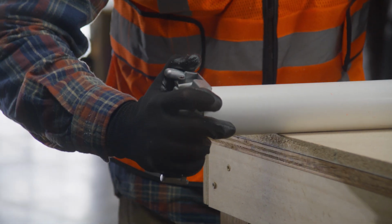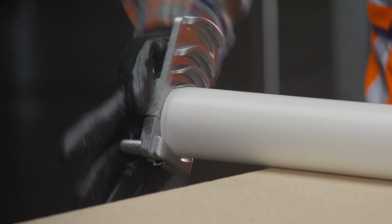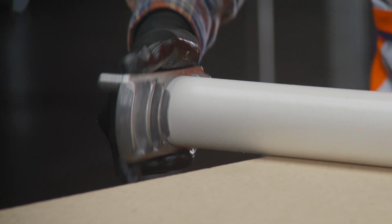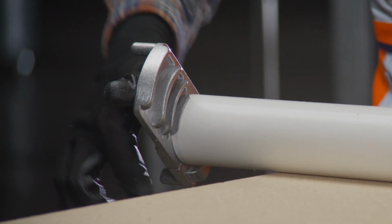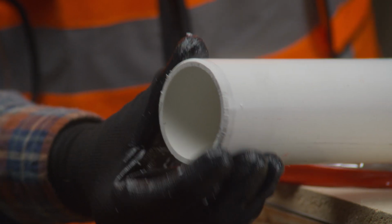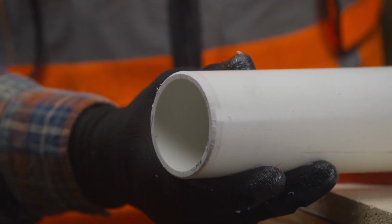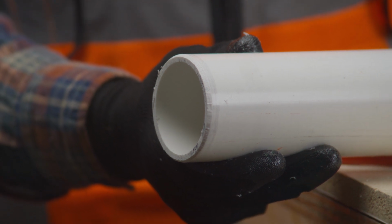Remove inside diameter burrs or raised beads with an internal deburring tool, knife, or power beveling tool. To remove the burrs or raised beads on the outside diameter of the pipe, use a file, external deburring tool, or power beveling tool that will produce a 3/32 of an inch, 10 to 22 degree chamfer or bevel.